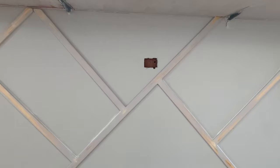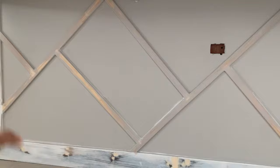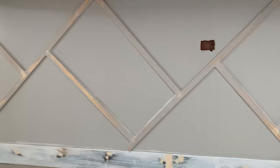I had to make all of these angle cuts to get the panels up. We used an adhesive — liquid nail — to attach them to the island. After a first coat of paint over the joints I realized there were some gaps, so I had to go back and put caulking in all the gaps I could see. Now I'm finishing painting it to see how it turns out.